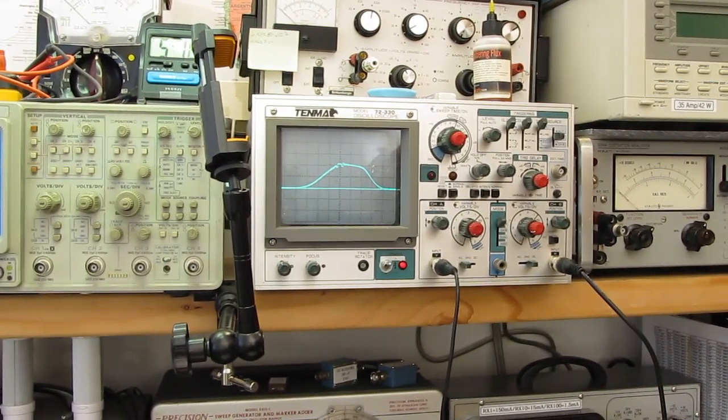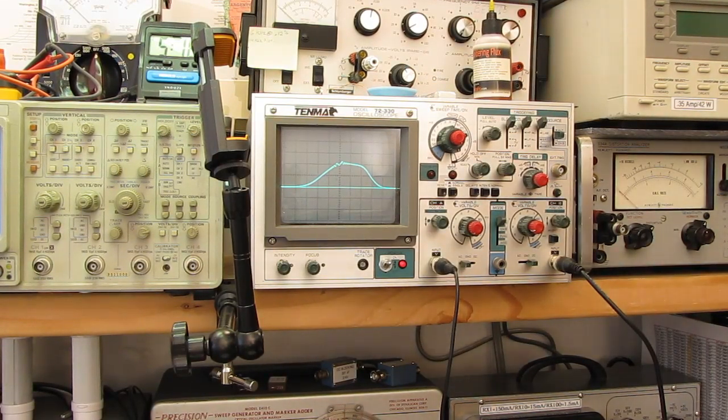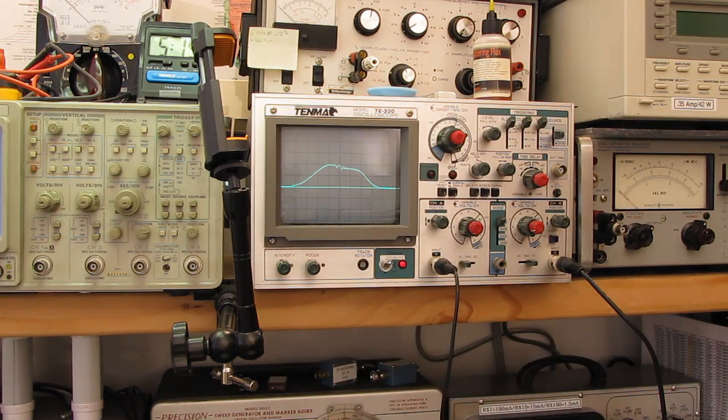So let's see what we can do. Where's my new diddle stick that doesn't leak voltage? That's not it. This is it. Okay. Let's see what we get. That brought that lump that's on the right down some, but it also brought us up a little bit on the right, on the left hand side. There we go. You can see how this is A3. You can see how that shifts the curve over. So we want to bring that probably there to that line just to the left of the 10.7.